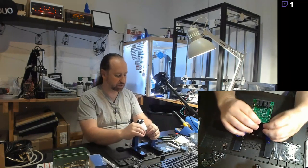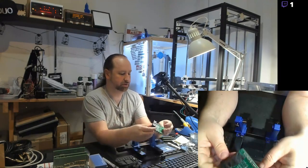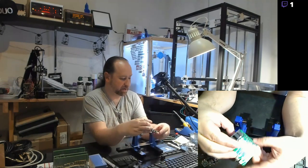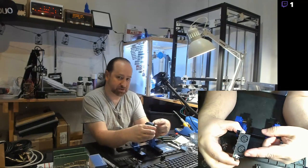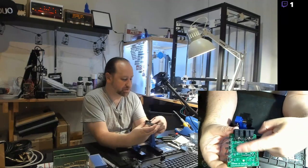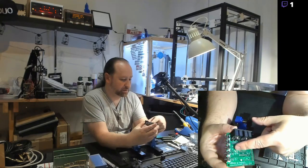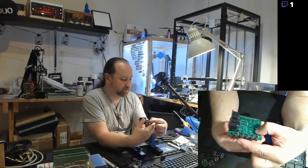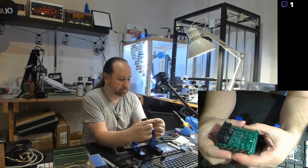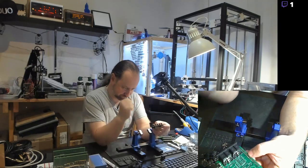And here's one of the initial boards. Essentially, there's the Raspberry Pi interface connector on the back, and then there are two serial port connectors for the Commodore itself. On top, there's the glue logic. There's going to be another OLED screen on the top and buttons on the front to control the disk image that's loaded and all the little fancy stuff that comes with it.